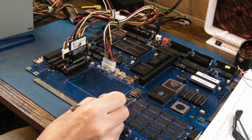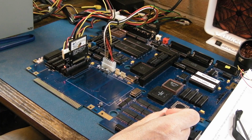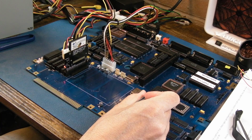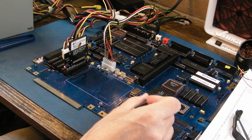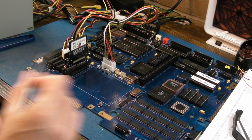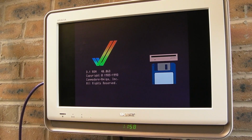I just got the brainwave here. I'm going to put the resistor back there. That's not going to give us 25 megahertz here, and it might not give us 25 megahertz here. This is the thing I'm thinking: if we just went from 25 to 50, and actually it didn't come up with an auto configure, it just worked. So I think that was one of those things where the person designing this thought it was a good idea to add that in.